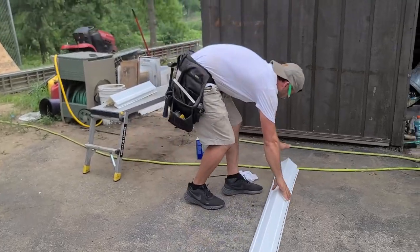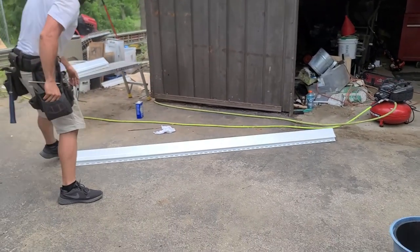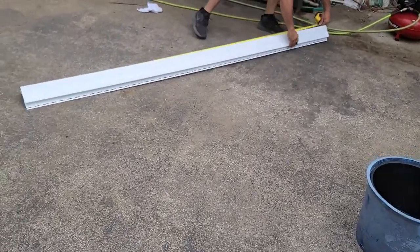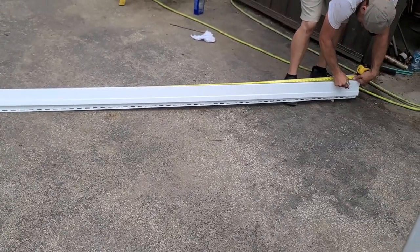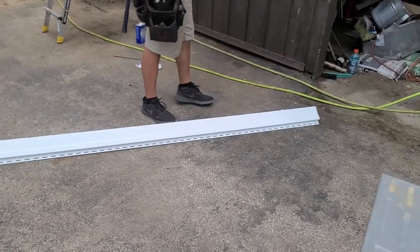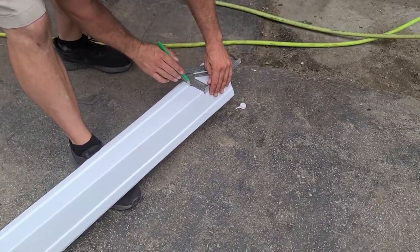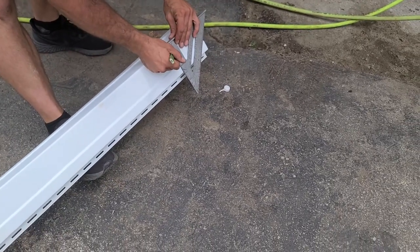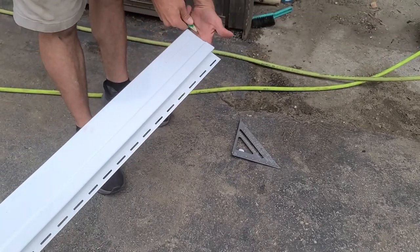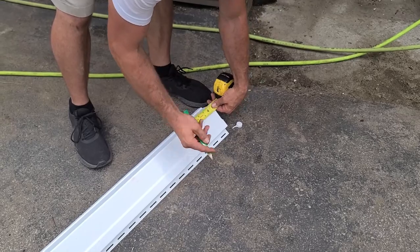All right, so now this is gonna be my bottom side. Always do it in a way that isn't gonna get you turned around. All right, so this is my bottom. We're gonna pull our 92 1/4. Okay, now that is going to be, again, where that fascia is, which is gonna be completely square on this side, right? And then we had our 1 1/8 inch right here, okay? And then you can just continue that all the way through, okay? But at some point, we're gonna have to start that angle, which is 3 1/8, I believe.